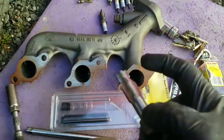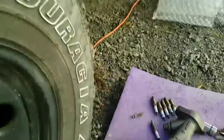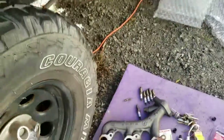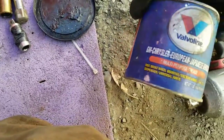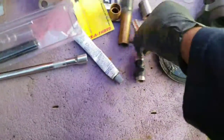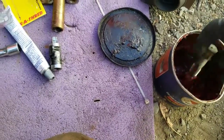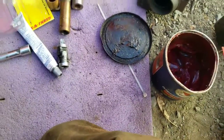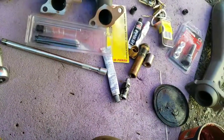I'm gonna fill this with grease and get the tapping going. Just use regular grease. Really cover it good with grease so it'll catch all the shavings and they won't go into the cylinder. I mean, you're gonna get some in there, but it should blow out.